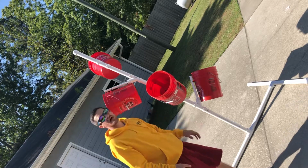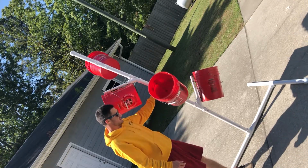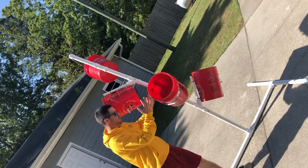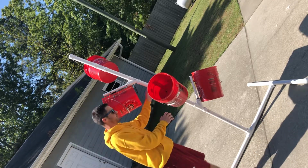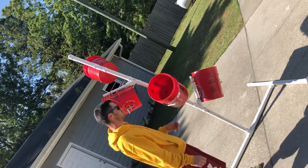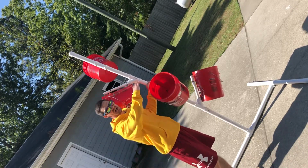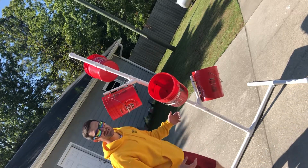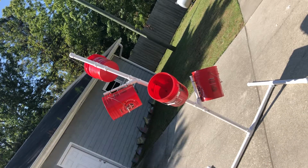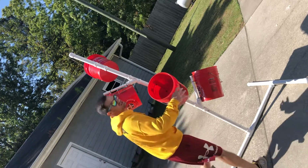So again, these set screws on the bottom, it's not very windy here today, but the 4 bolts that we ended up putting in, that's to help keep this structure. If you don't have those bolts in the bottom, this whole arm, the whole base could rotate, tip, tilt, and fall over. So you can do it without the 4 bolts and without having to screw into the PVC pipe, but just realize that your structure is going to be a little bit flimsy and will be susceptible to winds. What I'm going to do now, check to make sure that we're still recording, and I want to just tear this down real quick and stack it all together and show you what that looks like.